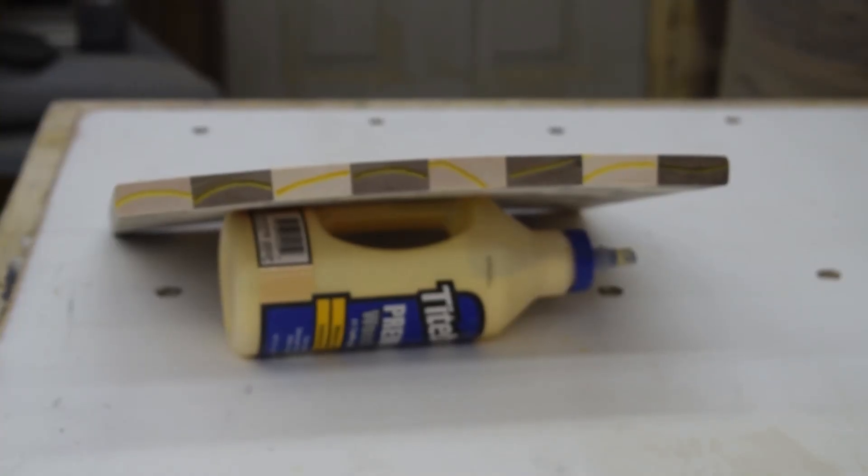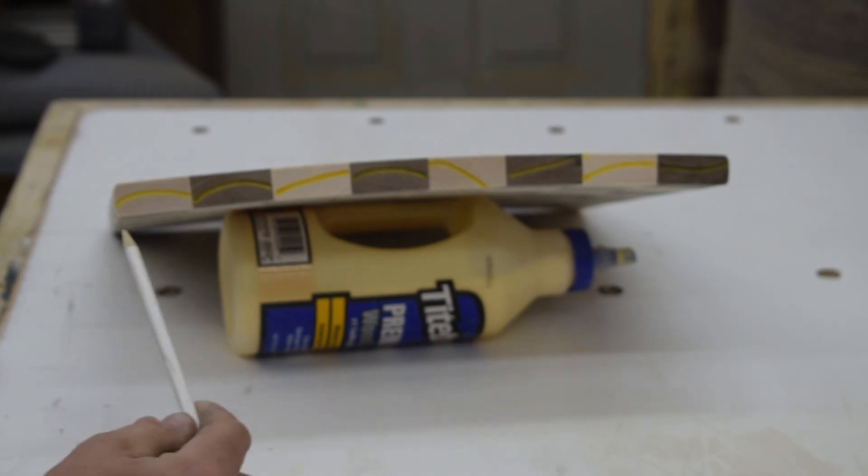I come back out the next day to find this surprise. I do not heat my shop when I'm not working in it, and since it's winter it gets well below freezing with very high humidity, and then when I warm it up the humidity drops rapidly and the wood moves. I've highlighted the grain direction in yellow.